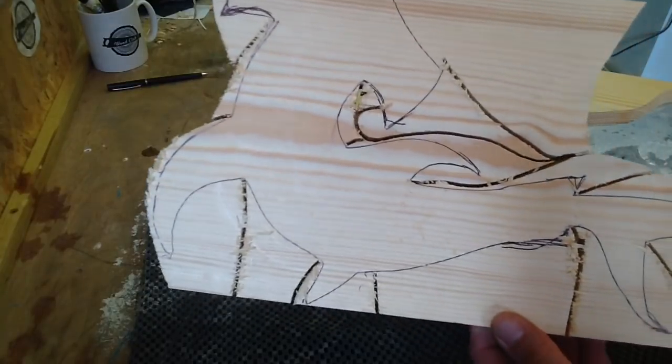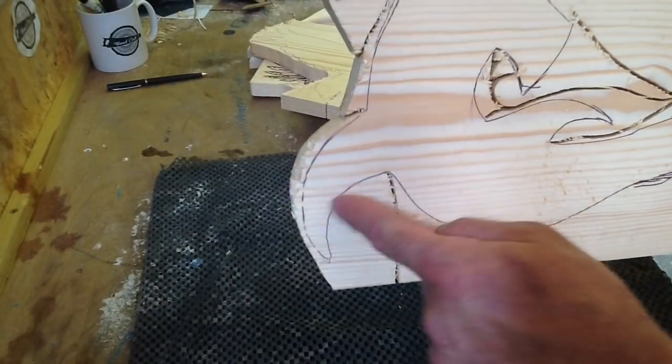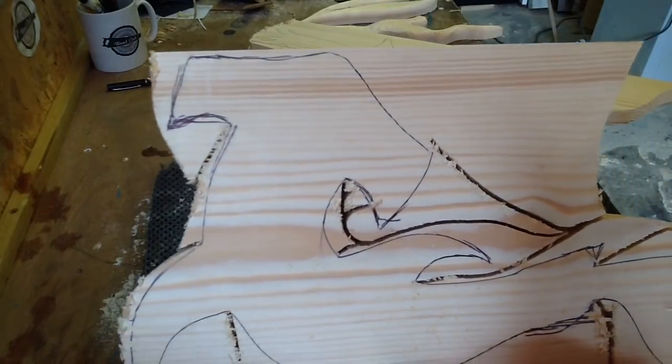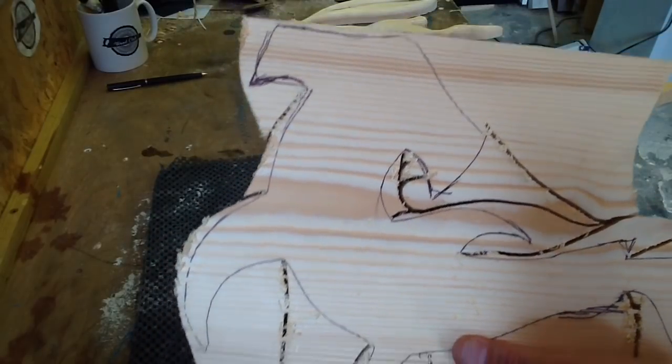The shark is obviously one of the worst culprits for any little tight corner. I've tried to do a relief cut on each one because I don't want to back it off too much on the blade — I don't want to stress the blade too much.